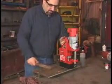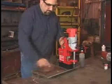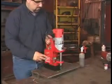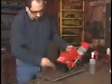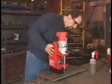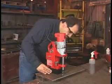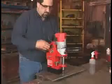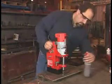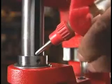The surface must be clean and smooth in order for the magnet to adhere properly. Remove any mill scale, paint, or rust — these decrease the magnet's holding power. Clean the base as well; remove any chips, burrs, dirt, or anything that gets in the way. Center the ejector pin over the desired hole location. The 4270 is now firmly secured to the work surface.